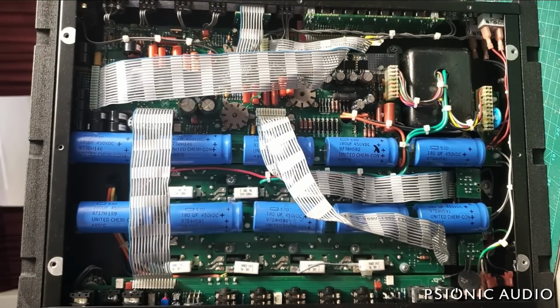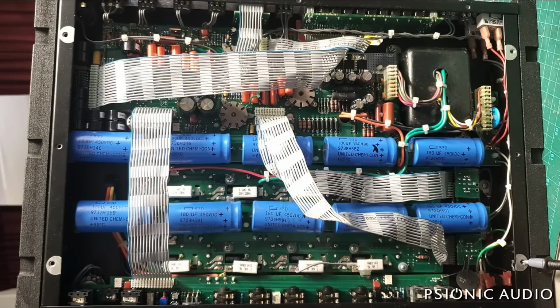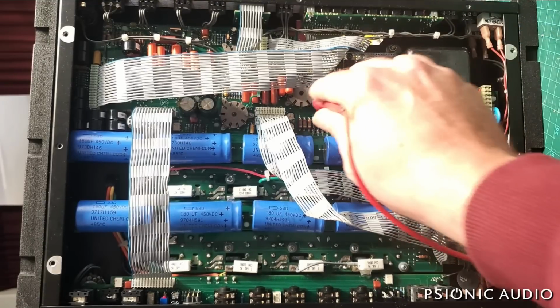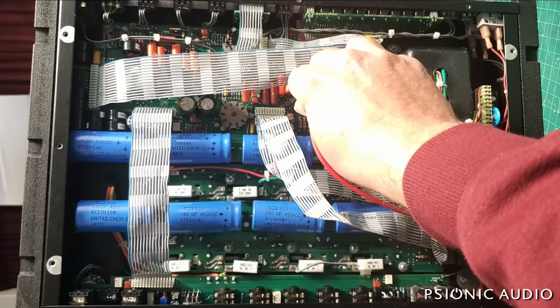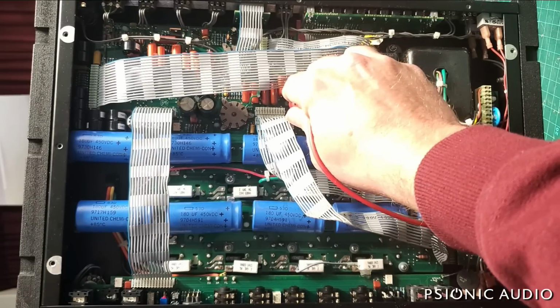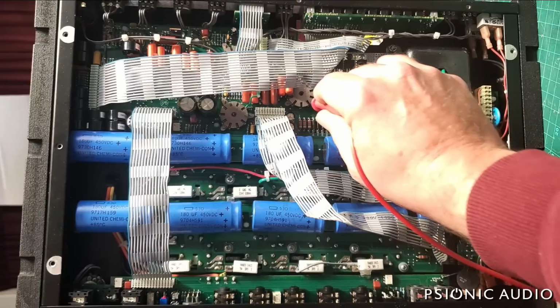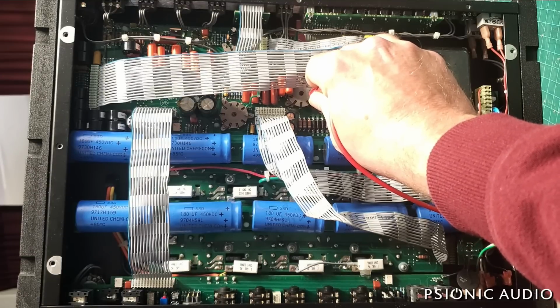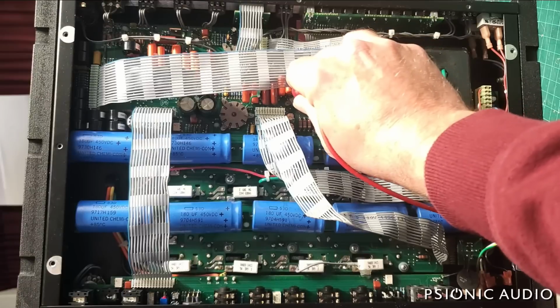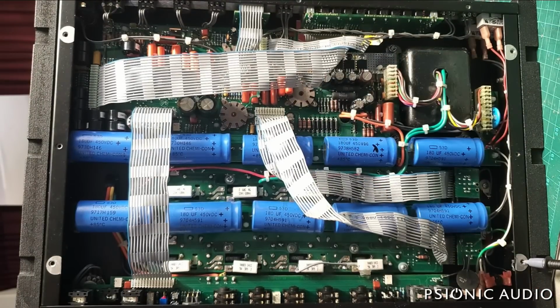Okay, if this is like the Prodigy, I know what rough voltages I should expect to measure at V2. So let's see if this correlates. I want to make sure that it's biasing correctly. 138, 130. That's about 40 volts lower than it says I should get, and about half what I should be getting at the cathode. So let me measure some resistors attached to that.